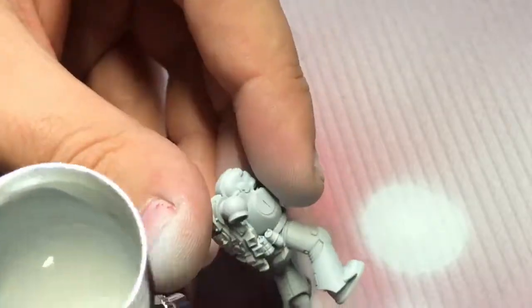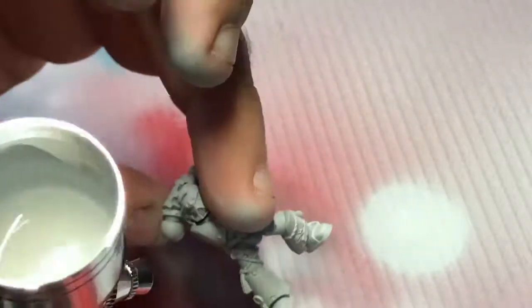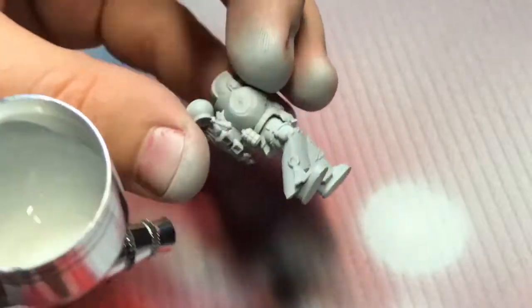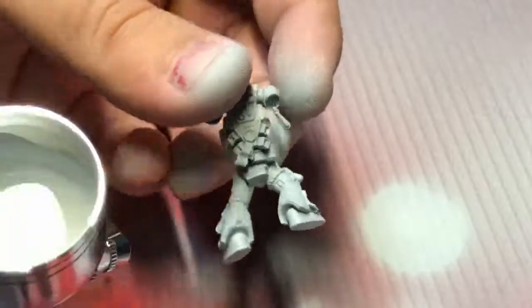It's got a small tank, so even though it'll be filling up the tank, which you'll then use for airbrushing, if it only charges up to 4 bar and at 3 bar it switches back on, on a 3 litre tank, it is really quick to get down that 1 bar. So that's when you're looking at the motor will be working a lot harder. Is it a cheap motor? Is it going to wear out after just, well, a few hours? And a low number of hours, as far as I'm concerned, is 200 running hours. I want something that's going to last, so unfortunately that does point towards a Bambi.